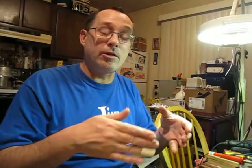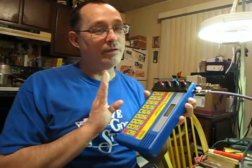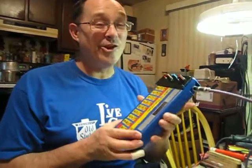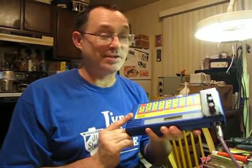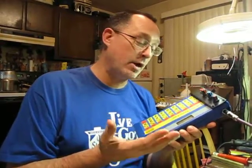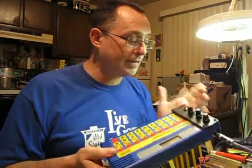So that normally closed switch, we cut that in on either the black or red wire coming off the battery cage. So at that point, when you do, and you will, they all eventually, after about 10 minutes, if you can handle playing with this thing for 10 minutes and hearing it speak in tongues, it's really obnoxious. It'll stop, it'll freak out, and then you hit the button. And then it resets instead of having to take the batteries out. I haven't done that to this yet.